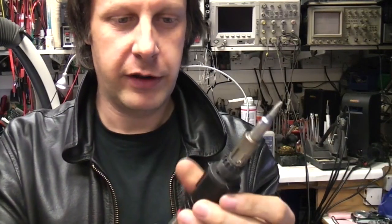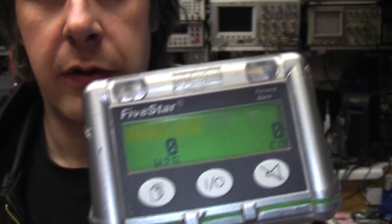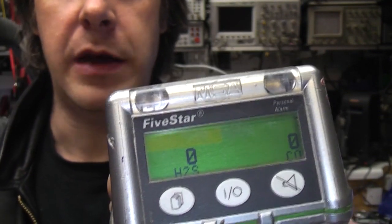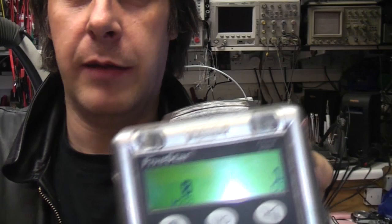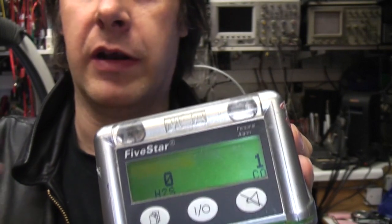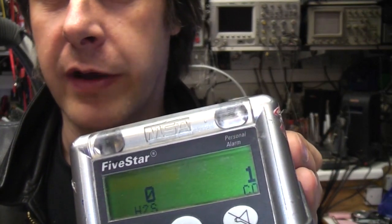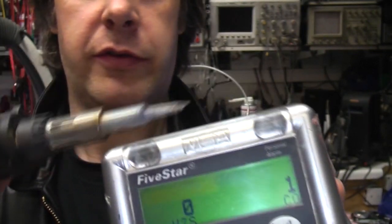So I've got my portable gas soldering iron. Hydrocarbon gases when they burn generally produce a certain amount of carbon monoxide as well, because of incomplete combustion. So let's fire this up — should be able to produce some carbon monoxide. Let's see what happens. If I just point this out so you can see the readings. There — that occasional bleep is just the device bleeping periodically to remind you that it's still switched on. Because lives could depend on this thing working, if it suddenly stopped working and you didn't know about it that would be very bad. It gives a positive 'yes I'm still here' indication. So let's squirt a bit of the exhaust gas near the sensors.